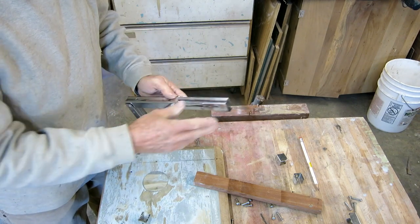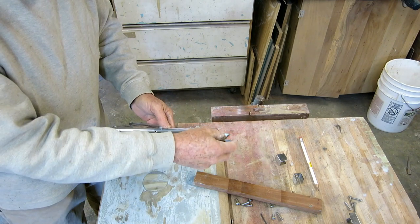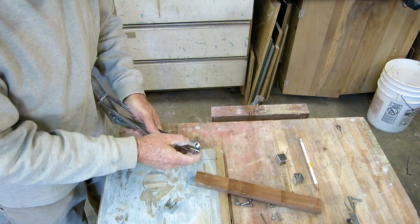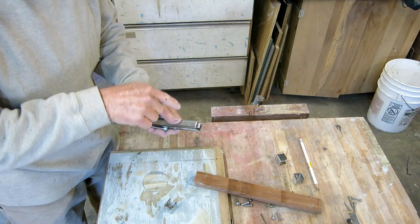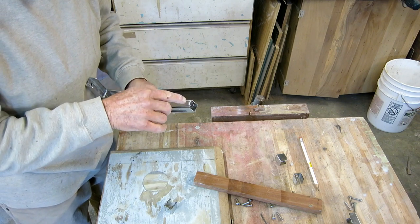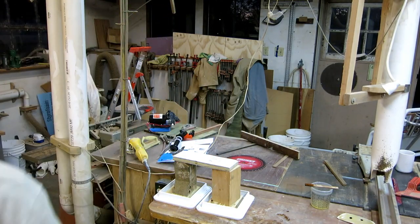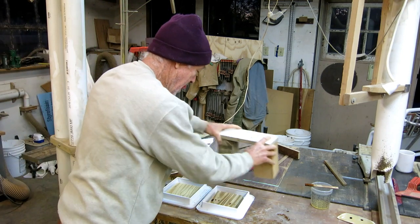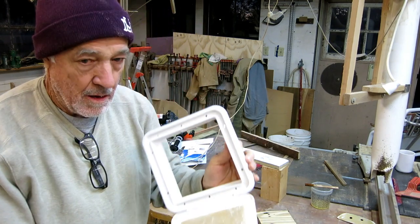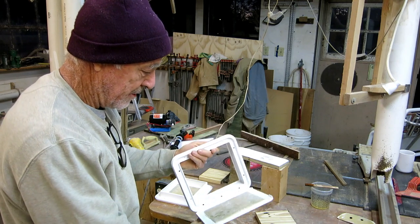I'm cutting these to make them shorter — that's a piece of cake. I rounded the edges so they wouldn't be so sharp, but a problem is I lost one of the screw holes at the very end. No problem drilling another one, but it's hard to get to, so I'm going to drill the hole through the little handle and through the frame, then slip the screw under there and use a screwdriver through the hole. I cleaned off the inside surface of the little doors — sanded it rough and glued two flat pieces of fiberglass on last night. Made a big improvement with not much effort — I'll just have to drill the hole where the lock set goes.